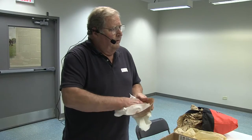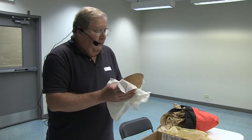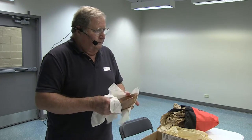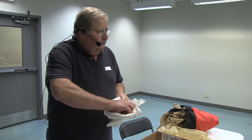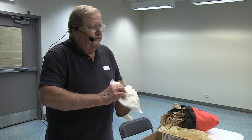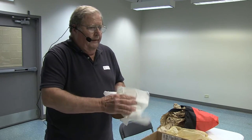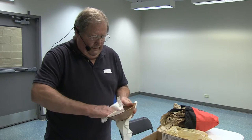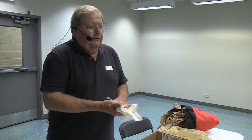So, after that first coat dries and you're sanding it, are you using a steel wool to sand it, or are you going back to? Normally, the first time I go over it, I use a steel wool. Okay. And then after that, I'll just oil it. It all depends how it feels. If I can feel anything on there, then I use something to remove that. Like a 1,000 grit sandpaper? Yeah, like the stuff I passed around. I really like that stuff. It's not meant to sand everything out. It's meant to enhance the coat, I feel. Now naturally that's probably going to get some fingerprints on it, but at least you can see what it's done.